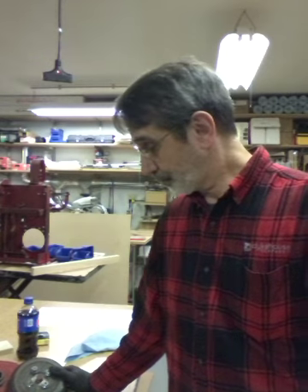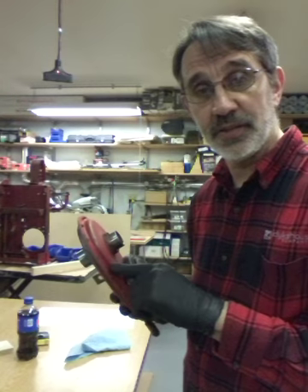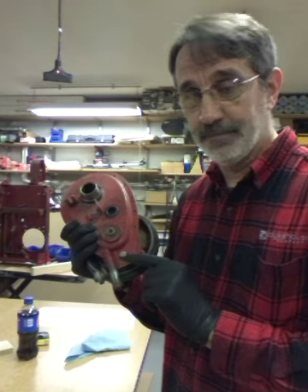My yard — my snapper bags are half sand, I suck up everything. I don't pick up twigs, sticks, pine cones, or acorns — this baby sucks them up, that's why I still have it. If you happen to be going down a hill with full bags and you hit your brake and this thing grabs, it will chances are break your chain in your chain case or break the chain in your differential. So you've got to keep your eye on this brake.